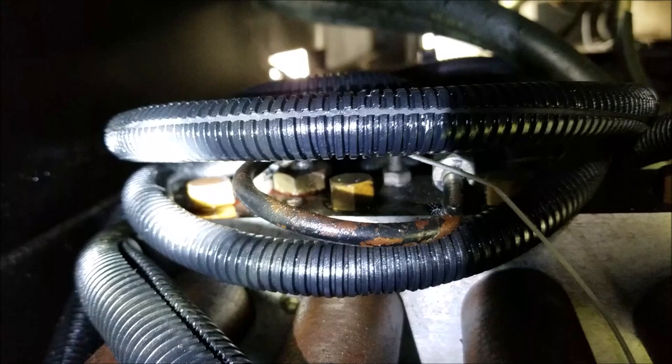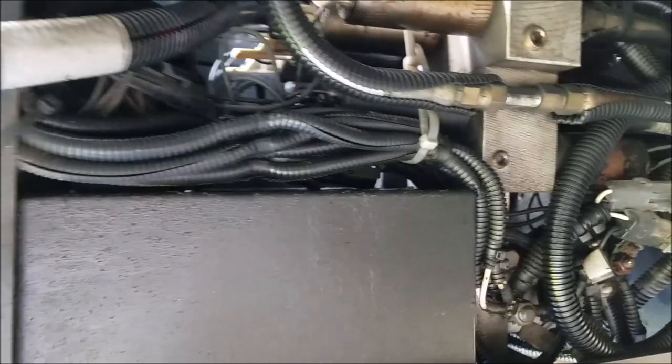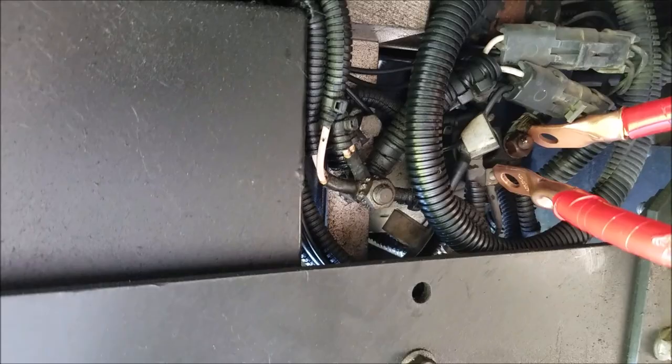Today's challenge is to get all this cleaned up, get the check valves out, find a new o-ring, and get them replaced. I'll show you how I tracked down exactly where it was coming from, because first I wasn't sure - I just seen oil up there, didn't know if it was a hydraulic line or a fitting. So I got my little jumper cable here to momentarily pressurize the system. This larger wire comes straight off the battery, and this is the signal wire that activates the solenoid. I'll show you how I found the leak - bump it - there you go, a nice big spray.